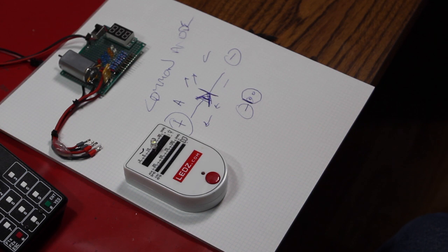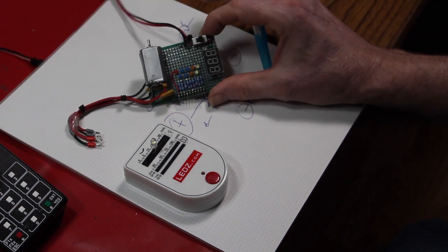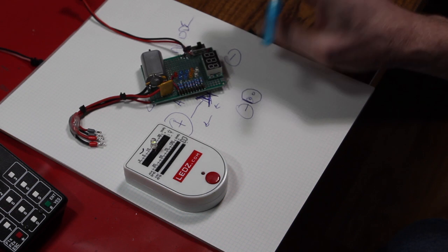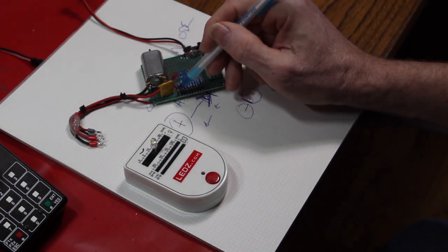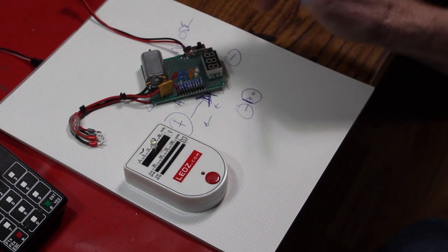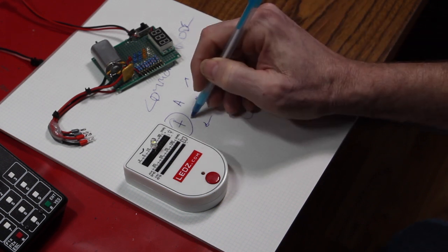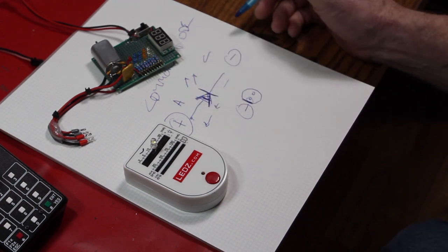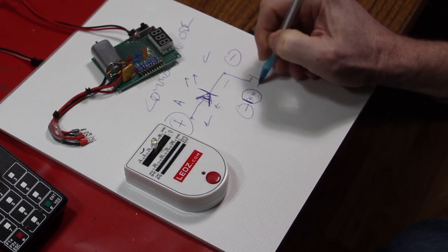Voila. So getting back to the Airwire controller, it is a common anode configuration, which means all of these LEDs I wired up in this little control device are simply run to one side. The very top pin is your battery connection, essentially 14 to 24 volts. And the anode side... the cathode side goes to a MOSFET essentially.